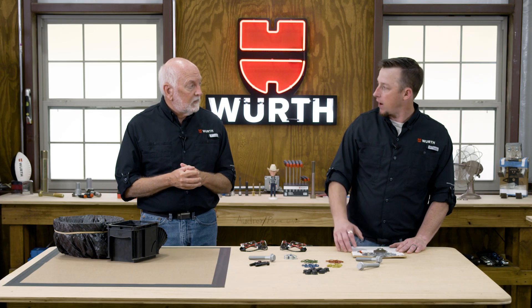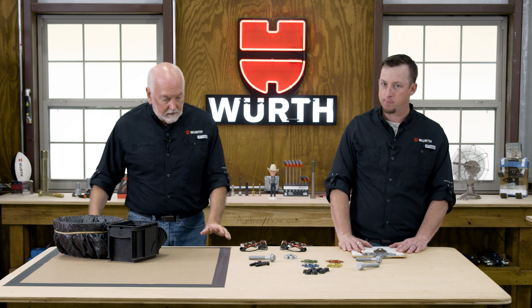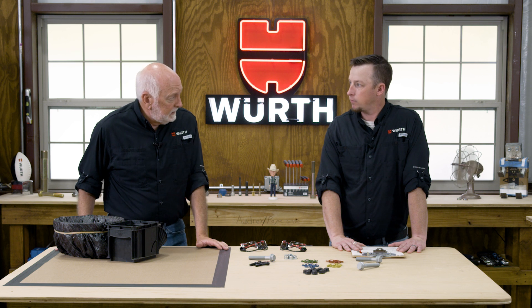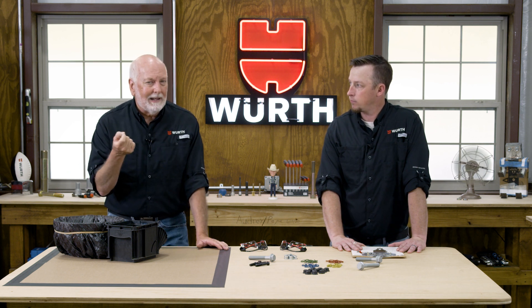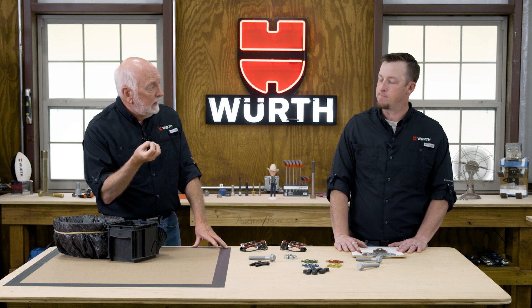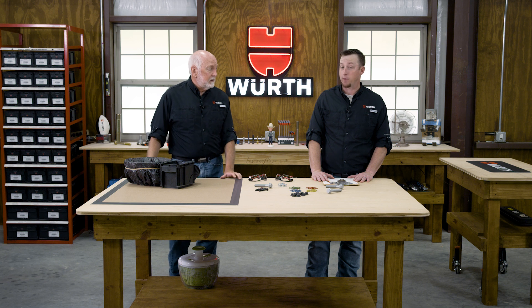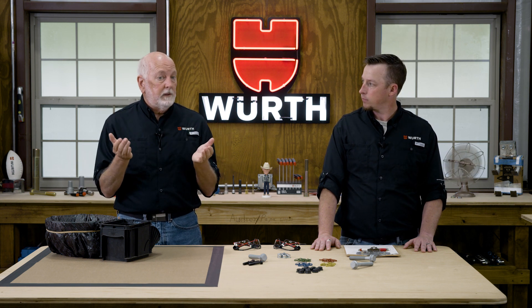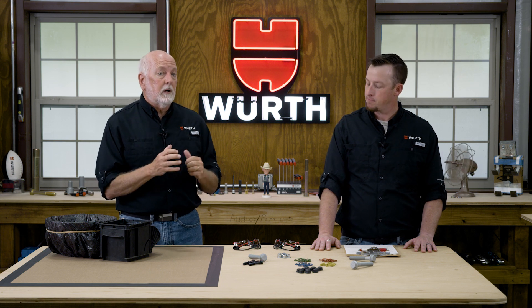Another thing we're seeing is actually having a zinc flake placed over an electroplating. There are a couple of systems on the market where you put the trivalent chromate on top of an electroplate and then a very thin one-to-two micron dip-spin formula on top of that, seeing 500 to a thousand hours of salt spray resistance — great for exterior use. And for bi-metallic protection, the zinc flake coating is about 10% titanium binder and also has aluminum, so it reduces concern about galvanic corrosion when going into aluminum applications instead of using stainless steel.